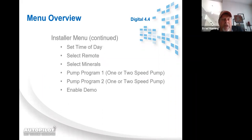Also in the installer menu, set time of day, select remote. That's if you're going to wire to automation. We don't even promote that anymore, so you don't even really hear me talk about it. It used to be that we promoted the fact that you could wire our systems to a Pentair, Jandy. Hayward wasn't out with automation back then, but anyway, and you would have to go to this to select remote 1, 2, or whatever it was wired to.